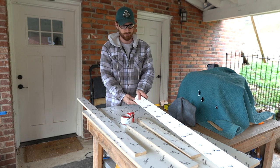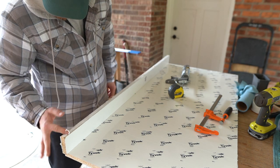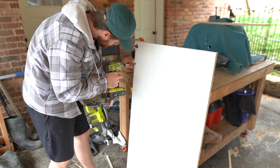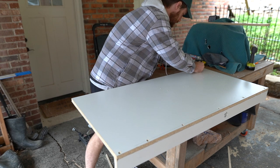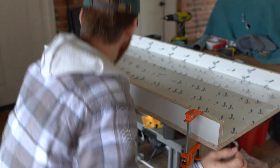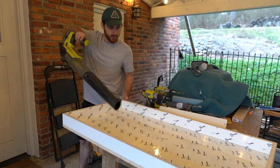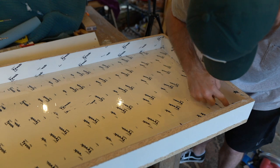I'll do my best to cover every square inch of this mold with the Tyvek tape. The next thing I'm going to do is apply a quick-drying silicone caulk to the bottom of the walls, just to ensure there is no leakage whatsoever. I'll also do that to the exterior as well. I try to give about 24 hours to ensure that's completely hardened and dry. Then I'll pre-drill my holes for the wood screws and put this thing together.